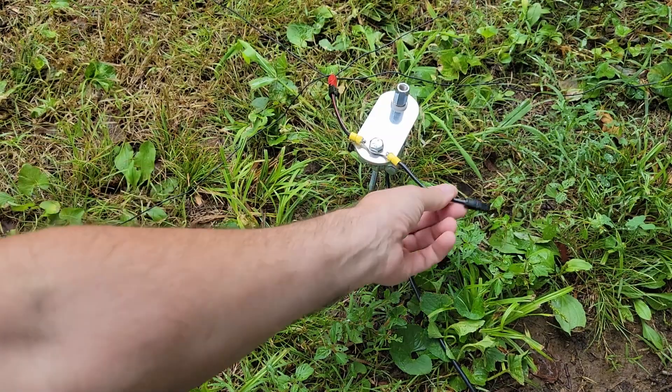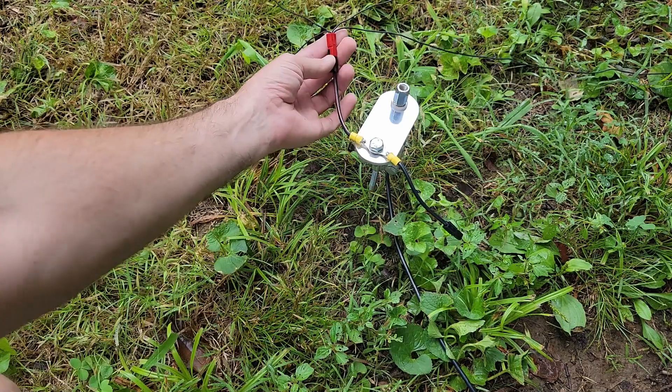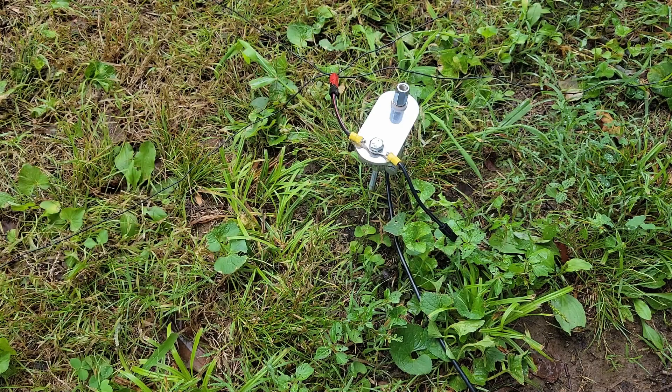If you remember from my last couple of videos, I have been using these power poles and my radial system. This is actually the reason why. I started out with this stake mount first, and have this power pole set up so I can put as many radials as I can fit on each side. I'm running four 10-meter radials on this one today, and that's going to help us get this antenna a nice solid ground plane to push against. I use this with all of my different vertical antennas, and obviously for a dipole you don't need it because you've got the other half of the dipole.